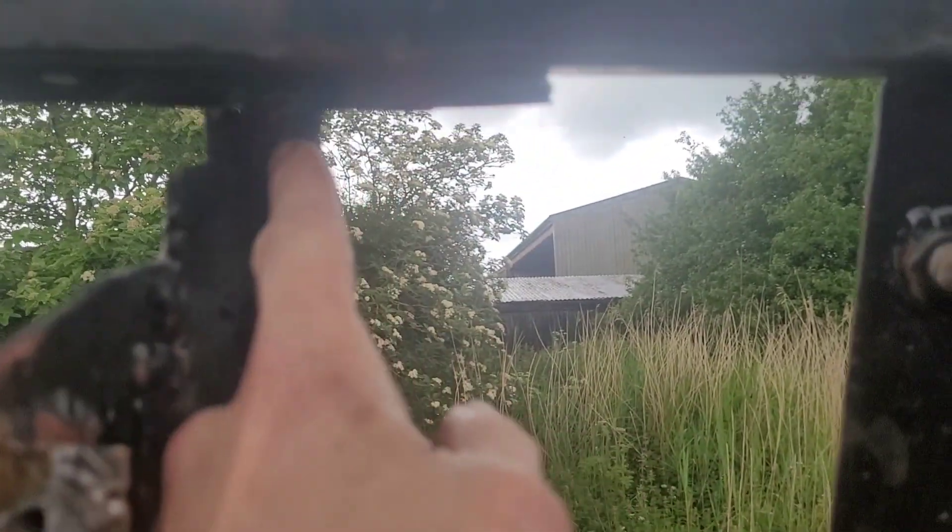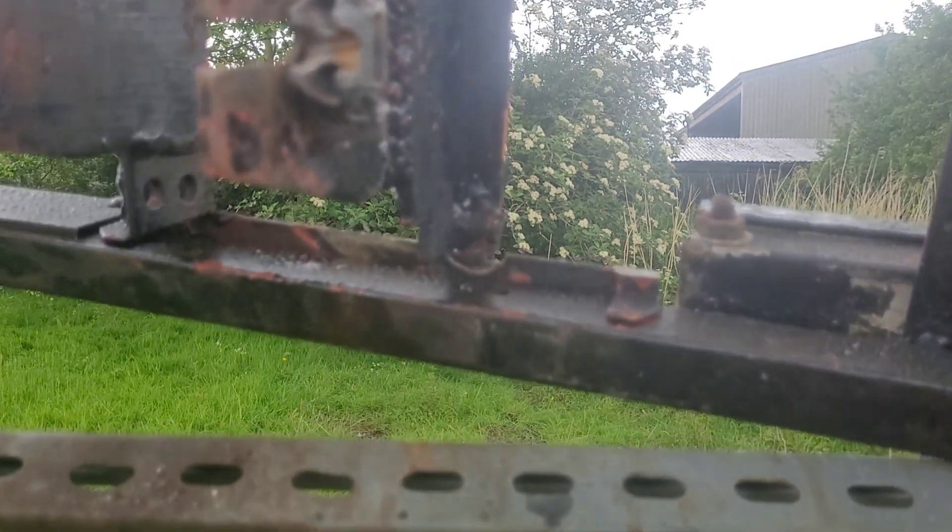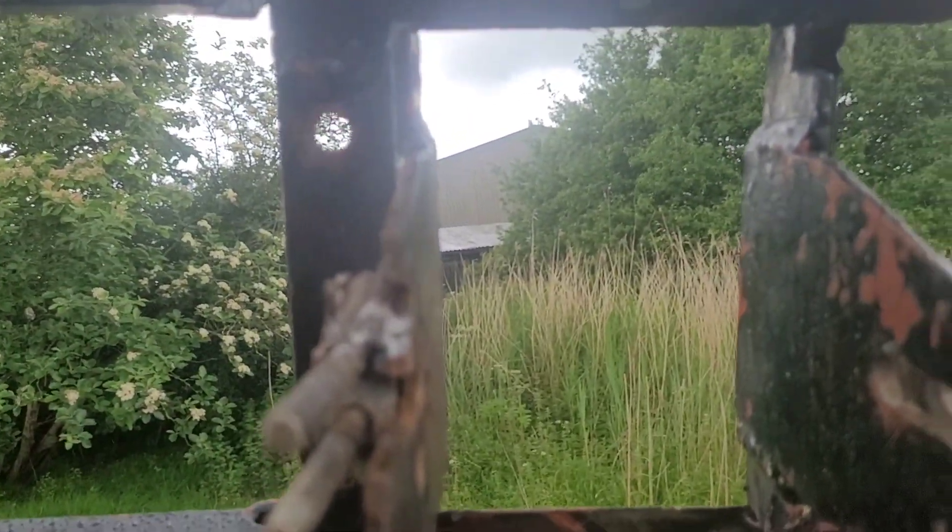With regards to this it worked out quite well. What I ended up having to do was welding two bolts on this end and we've got the bolt holes through that end, cutting — because this used to be here — so cutting that and re-welding it is essentially the easiest way of doing it.